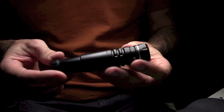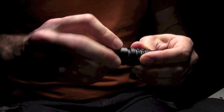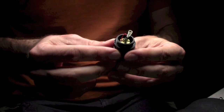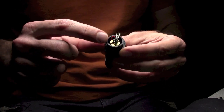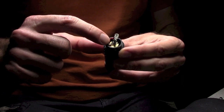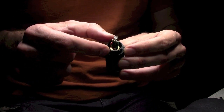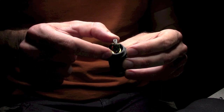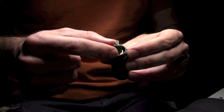One day I was curious and wanted to see what was inside this thing. So if you take off the battery cap and take off the rest of this barrel, you get to the guts of the light. Inside there's a little brass housing that holds the actual laser itself. It's got a couple of little holes and slots in the side for a special tool, but if you stick a screwdriver in there and knock it counter-clockwise you'll loosen it up.